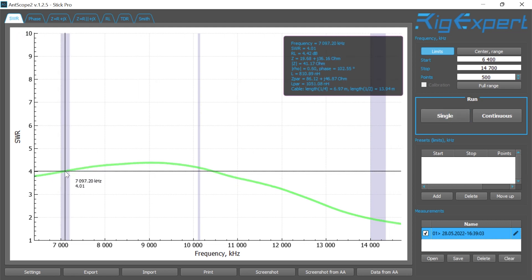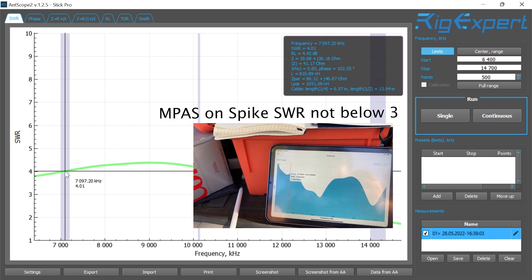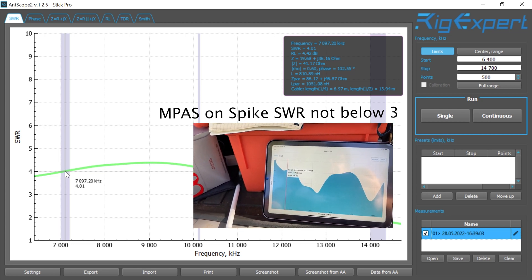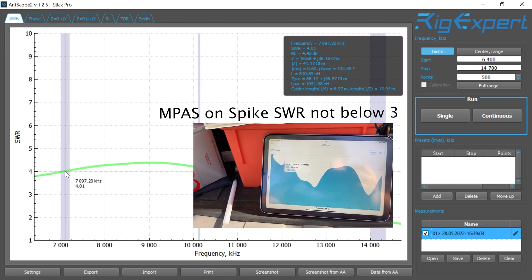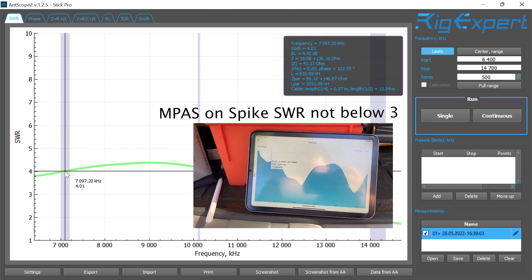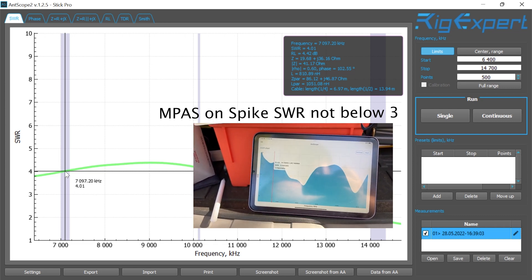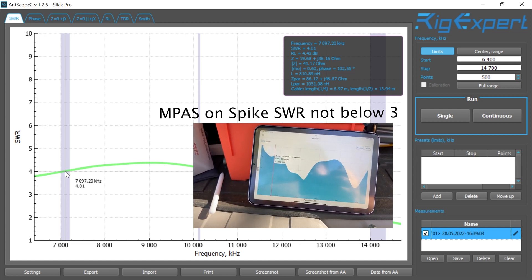In the middle of the 40-meter band at 7 MHz, we can see an SWR of 4. For an emergency you can definitely use that, but I definitely wouldn't use it for regular use. I wish it were lower — it's not, and I haven't been able to lower it even with a spike and wires. At home the dirt from the ground gives me an SWR below 3, like 2.4 — that's acceptable for me. But most places, even with radials, it just doesn't do it.